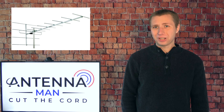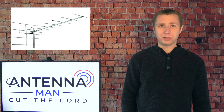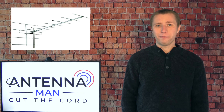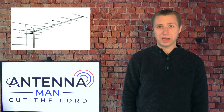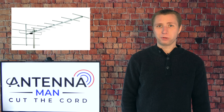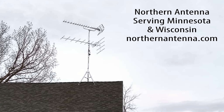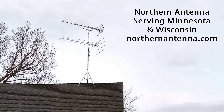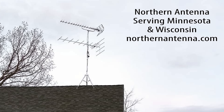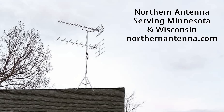This antenna performed the best on the high VHF band out of any antenna I tested. Some of you probably saw lower signal levels on some of the UHF channels and thought this isn't such a great antenna. Understand that this is a dedicated VHF antenna, so it's going to have all the gain on the high VHF band. It's not meant to be used as a single antenna to pick up all the stations on both the VHF and UHF band. I see this antenna as great for two scenarios. The first is if you want to combine two very high gain antennas together for the highest gain possible compared to using a combo antenna — great if you live in a very fringe area, DX, or have trouble picking up a certain VHF station no matter what outdoor antenna you try.